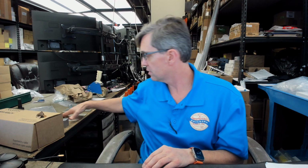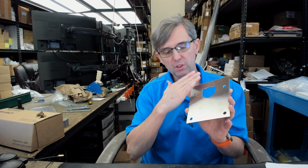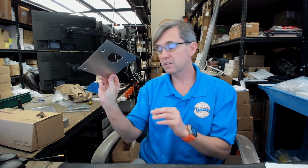The fact of the matter is they're probably doing everyone a service by using stainless, because solid stainless with nothing but a brushed finish is the most durable of all finishes, where 652, or you might know it as 626, that's plating. That's something that can wear out. Now, you're not really going to touch the floor plate like you would a push plate or even a kick plate, but the fact of the matter is this would end up being the most durable of all finishes.